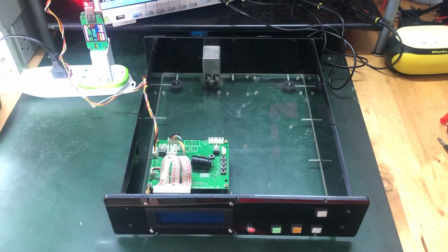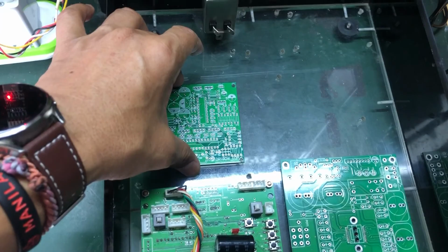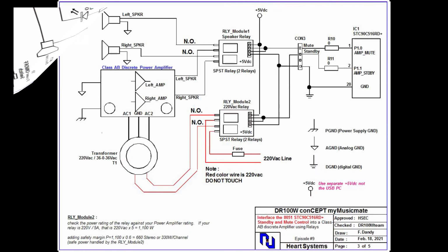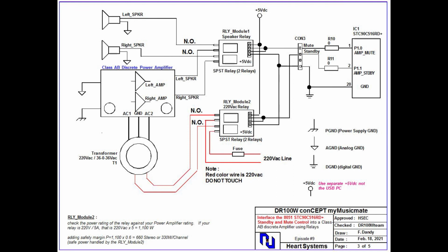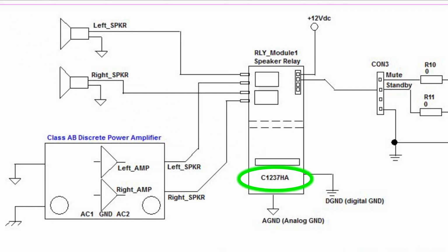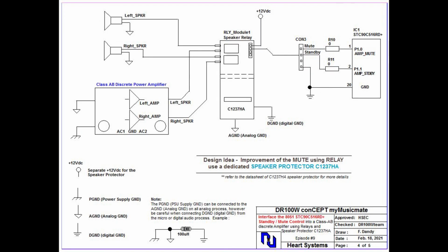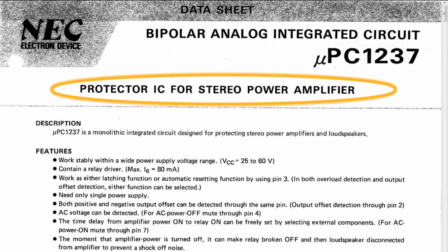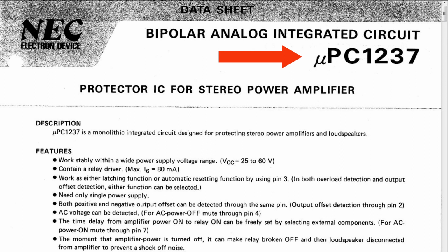For the time being, while we are developing all our hardware and its dedicated program, should you decide to add it into your existing power amplifier right now, I also expand the idea to make use of a speaker protector using the NEC chipset, the UPC1237HA, which is a dedicated chipset for speaker protection. We will not be discussing it here. It's going to be a separate video, but you can probably explore the idea and check the speaker protector datasheet to give you more information. You can find it on the download link, which I shared in the description below.